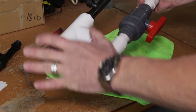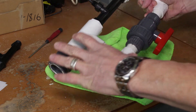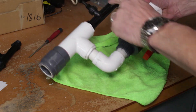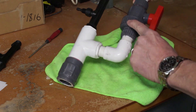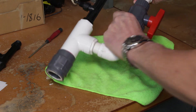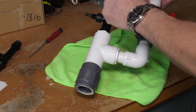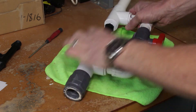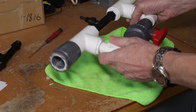I have a Mazzei and bypass that's been removed here. The first section of this cleaning process you don't actually have to remove the Mazzei from the system, but for the second half you may need to do that. If you did, you would unscrew this part here, then wind off this whole end off the Mazzei, and then unwind the Mazzei from this section here.